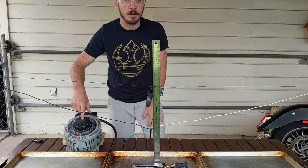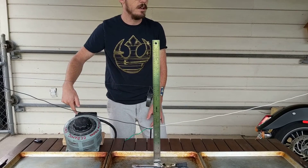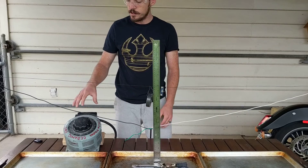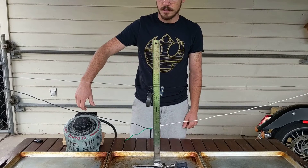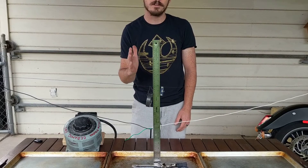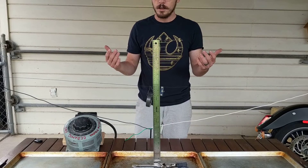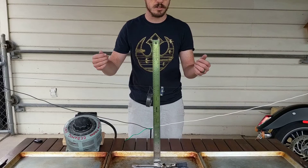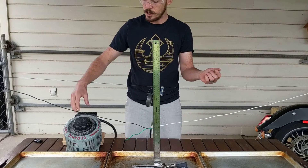These wires come to what's called a variac. What this allows me to do is turn a dial all the way from zero up to 100%, and I'll get 0% to 100% of the voltage — this is 120 volts. As I start to turn this dial, it's connected to the ends of this wire with an AC current, so it's going to start shuffling electrons back and forth along the wire. As electrons shuffle through it, the wire starts to heat up — the electrons essentially collide into the atoms and impart some of their energy. Let's see this happen.